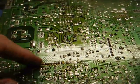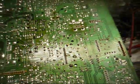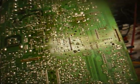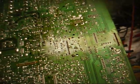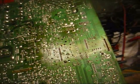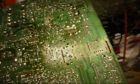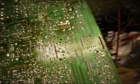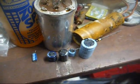Okay, the AKB board is resoldered and back in place, and I also resoldered the vertical output IC. That's another cause of a common problem in all brands of sets, loose connections on the IC pins. Although those seem to be in pretty good shape, I just went ahead and resoldered them, and now I'm going to pull out some capacitors and check them that are known to be problems in these sets, and if they seem to be a little iffy, we'll go ahead and replace them.